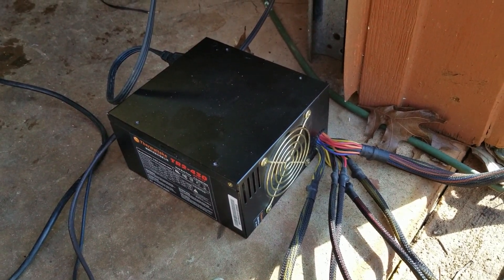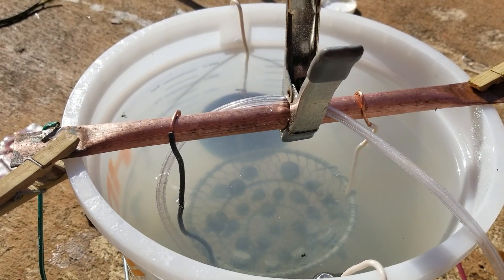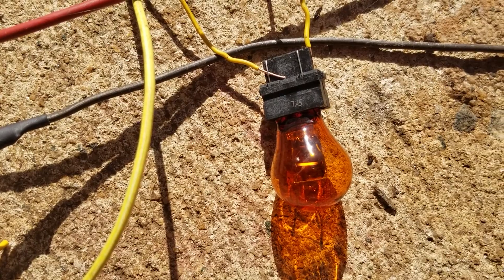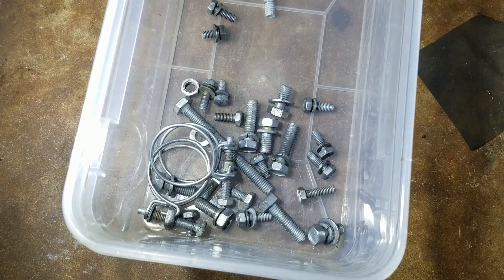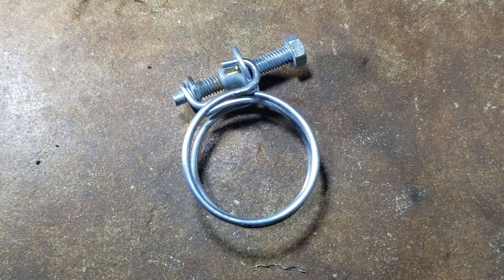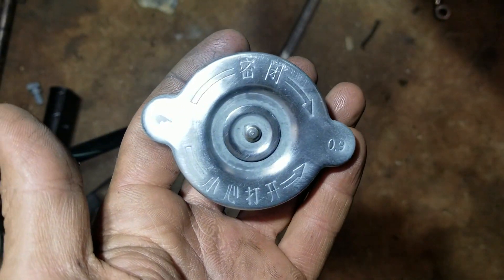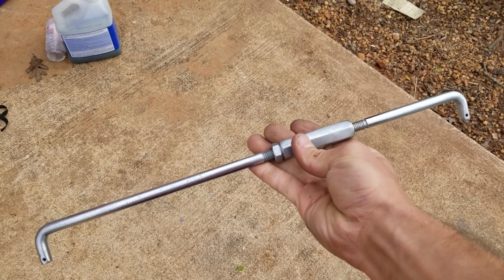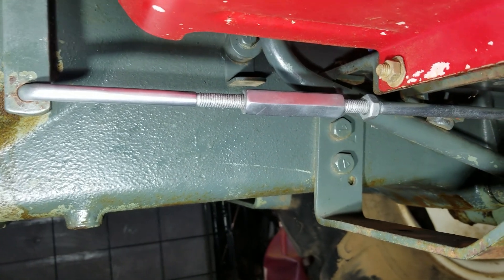Don't even think about just hooking this straight up. I'm using the red wire, which is five volts. This thing would pull a ton of current — like three or four amps — until it would just cook the solution. You've got to control the amps. That's why we got the light bulb in here. It's limiting the current and then turning it into heat — it's like a resistor. Hardware came out great. Nice and shiny. Look at that. You can see it missed a couple spots — I got to fine tune it a little bit. Here's the after — it's so shiny you can't even get it on camera. Looking brand new. Back on the tractor. Man, that looks good guys. It looks good as new.